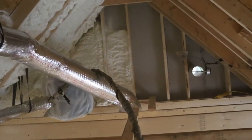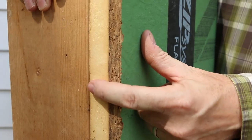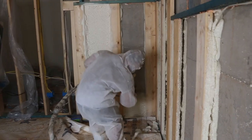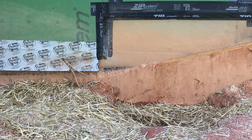To sum up: we've got an R19 roof with spray foam insulation. Our walls are R29, with our R6 foam on the outside and then our R23 dense-packed fiberglass. On the inside of the basement walls we have R7, which is one inch of closed-cell foam, and on the outside of the basement walls we have that fiberglass layer, which is R5. Add to that the thermal mass of the wall itself and the fact that most of it is underground, where the ground temperature is a constant 50 degrees, so we're not as concerned with thermal bridging occurring underground.